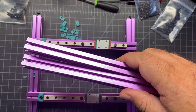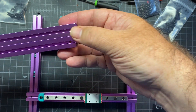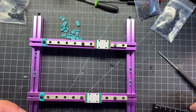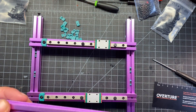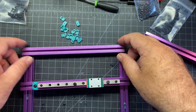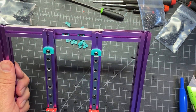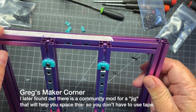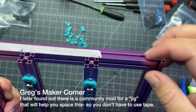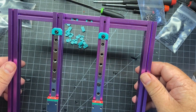Now we're ready for the next step. We're going to need two more extrusions — C extrusions, so they have holes at both ends — and those are going to go on the sides. You're also going to need your ruler so you can measure the distances. These are just going to slide over, and then you wrench through the access holes. Something that helped me with spacing was using a piece of tape and marking it carefully — I marked 58 millimeters across on the top and the bottom, then double-checked all my measurements.